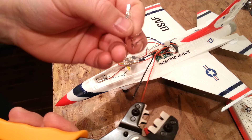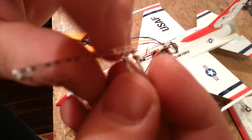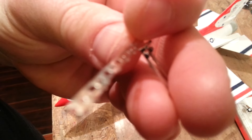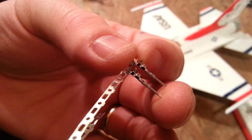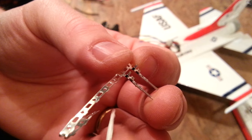I got one for the positive, one for the negative, and the tip, and I'm going to get my tool out. If you've ever seen my videos, you've seen this tool — it's a Hobby King tool. It's designed to build servo ends, and in this case it works for these too. The way it works is you cut back and strip back a part of your wire, and you're going to slide the copper through to the first notch.